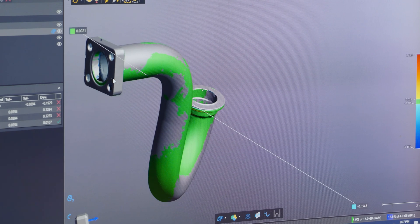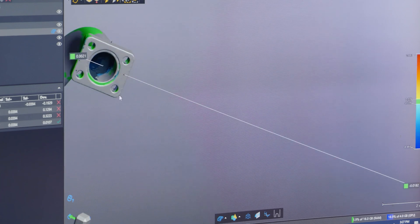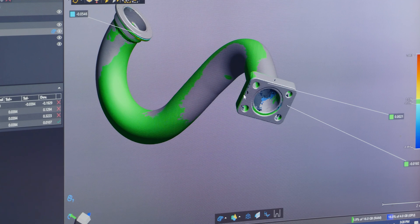Still, even at 54 thousandths, that is pretty accurate for mandrel bent stainless tubing, especially 120 wall that has a lot of spring back. Over in different areas like the flanges, we're at 18 thousandths difference between the faces of the flanges. You can't see anything major just by your eyes, so normally you can do a visual inspection and tell that it is very close. But if you need to get really close, you can click on it and see all the differences.